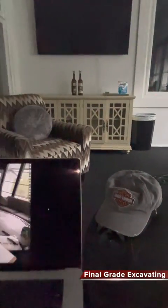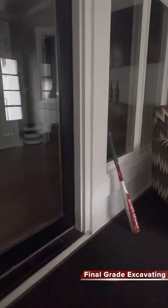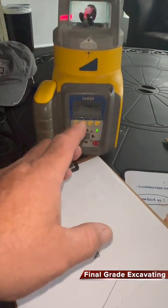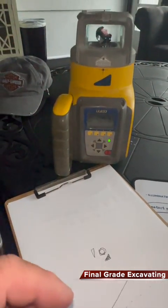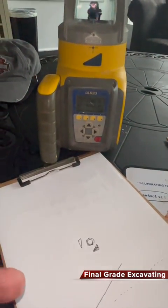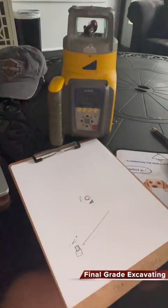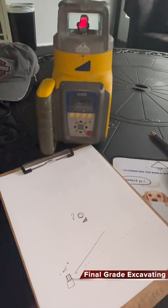These things are so amazingly accurate, it's hard to believe. Look at what it does in the camera — that's throwing that beam, and that's what you measure down from. Two percent is great for grass sod yards minimum. Your swale should be no less than that from your house — anything in grass minimum, if you don't want your lawnmower leaving ruts and making it worse. Half percent — they do a lot of parking lots with that, but that's a little light. Really should be one percent, or almost an inch in 10. That way you don't have any puddling or water absorbing and freezing in the winter. Two percent is the minimum you should do, which is a little over two inches in 10 feet.